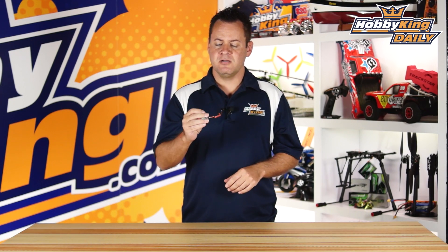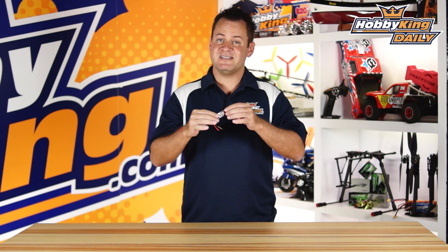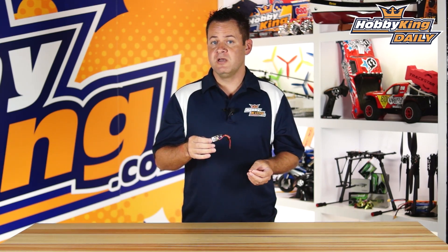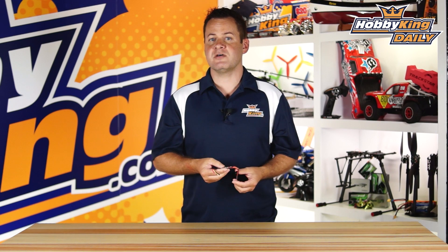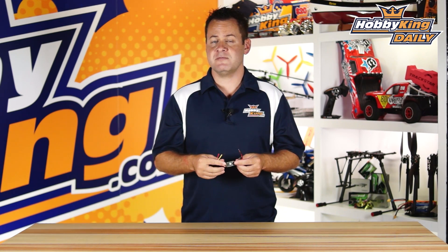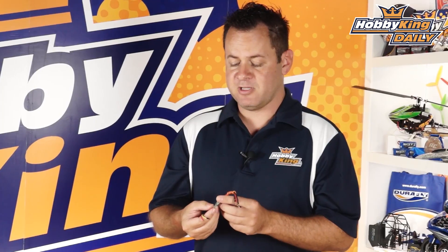The opto isolation is a really nice feature — it helps with sync issues on some ESCs because of that grounding isolation. Other than that, it's the exact same size as the 12 amp AFRO V3. You could even run three optos and one with a BEC instead of running four BECs and cutting three wires, and you'd still have that functionality. The software, footprint, weight, and size are all the same, so it would absolutely work in that type of application.